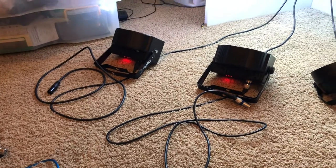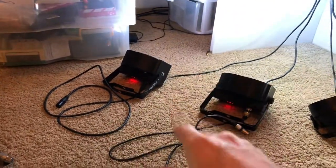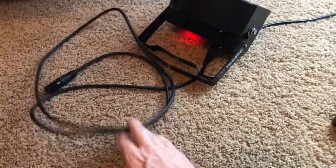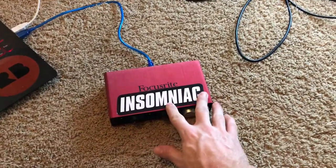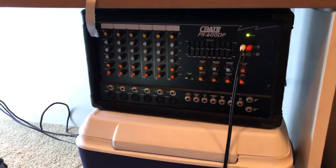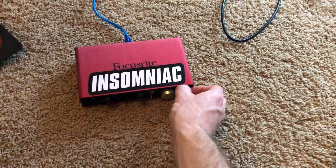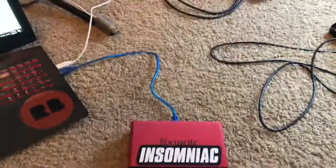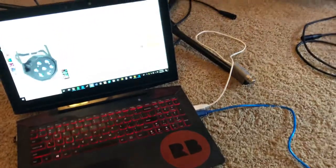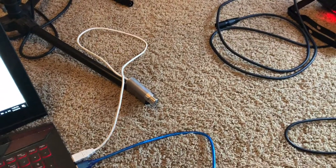When I bought these, I started getting this terrible noise over my speaker system, and eventually I narrowed it down to these YeeSight lights creating some electrical interference in the entire DMX line. Before I show you what's happening, I'll show you my setup. I've got my computer running music through my USB audio interface, which is connected to an amplifier and some speakers. I've also got a DMX interface connected to the computer via USB that controls a universe of DMX lights.